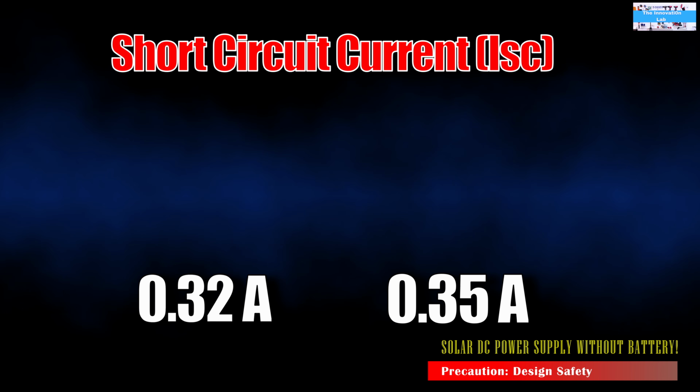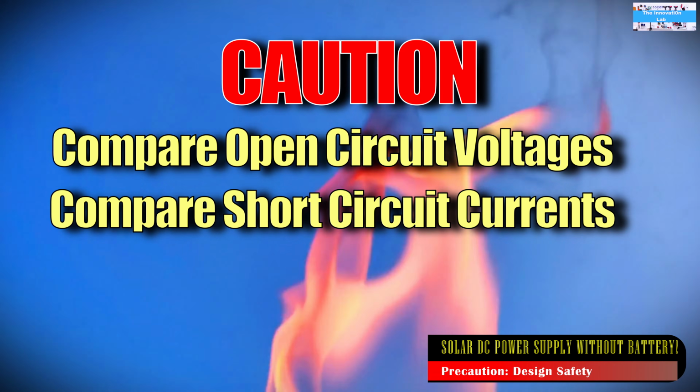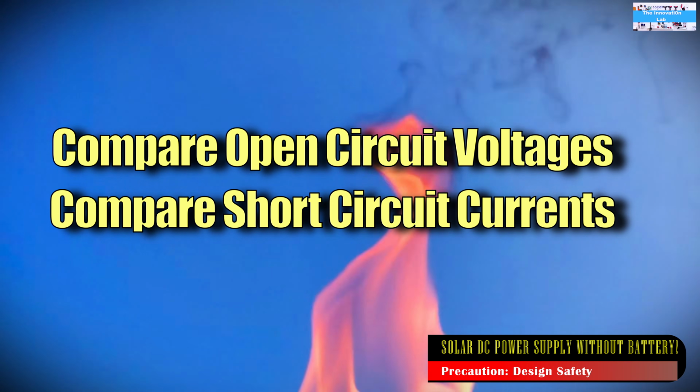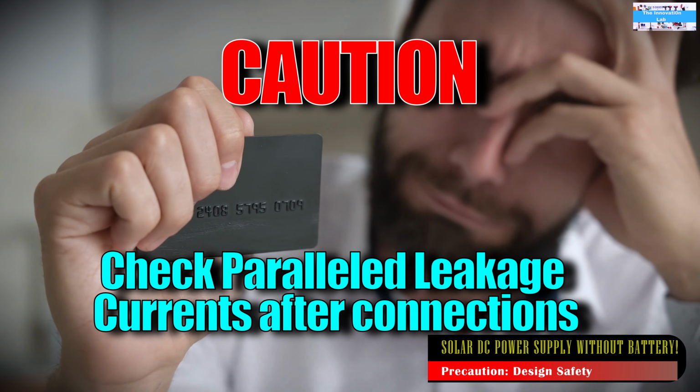If you're going to be doing something like this, make sure you pay attention to everything that I'm talking about. If you connect a bad solar panel in parallel with a good solar panel, you may end up damaging all your system, because the bad solar panel is going to end up shorting your good solar panel, and that will not be good. You could overheat them and basically damage all the solar cells on your panels.